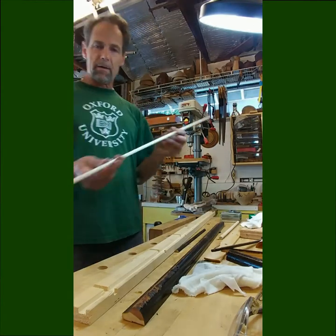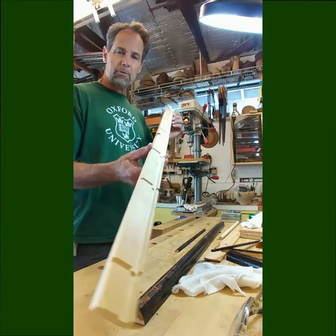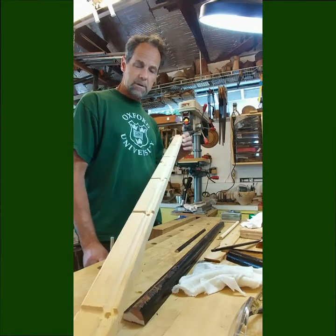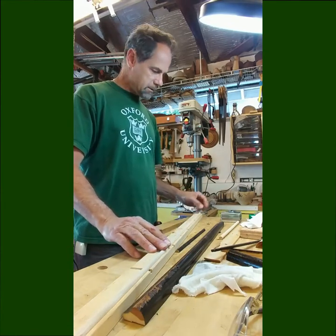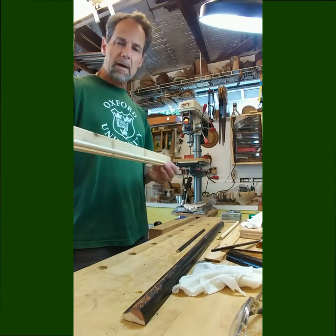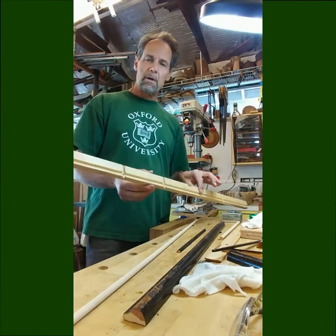I have a three-foot piece of that right here. The way I'm going to do it: I took a scrap piece of wood and cut a groove in it that is basically half the depth of those three-eighths inches. I'm going to take that dowel, temporarily glue it into that groove, and then run it along the fence in the table saw and cut half the dowel away.